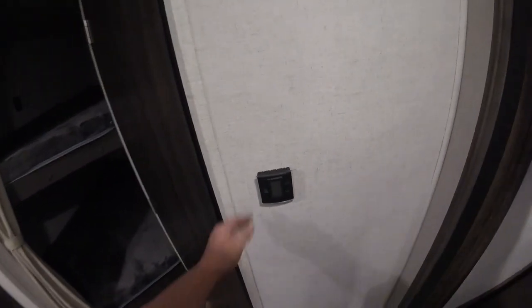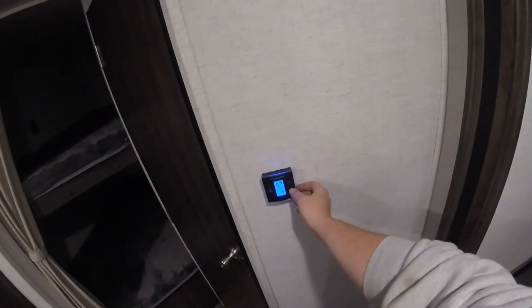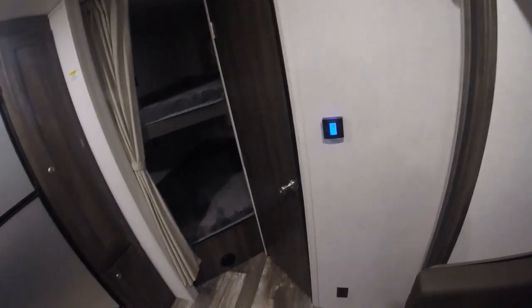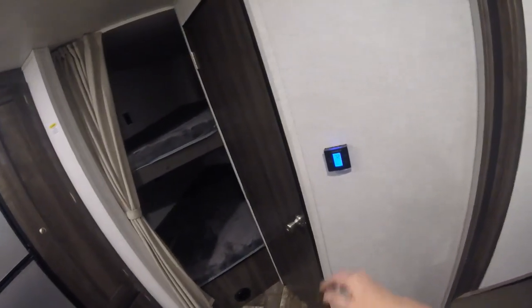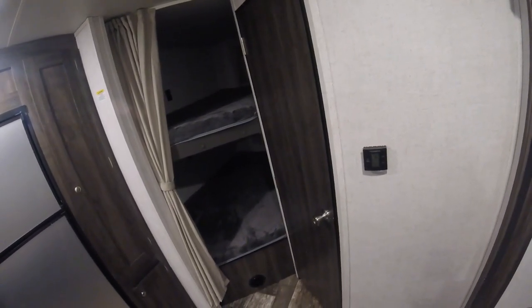This is your thermostat — it's what they call a capacitive touch unit, so it's not actual buttons, you just need to touch it. If you push hard on these they will stop working. The first press turns it on and you scroll through settings. First is fan: auto, high, and low — this runs just the air conditioning fan to circulate air. If set to anything other than auto, that fan speed runs for both air conditioning and the furnace. Next is air conditioning — set it to the temperature you want and it cycles on its own. The furnace works the same way. The furnace runs for 15–20 seconds before it lights as a safety precaution, and once it reaches the desired temperature or is turned off, it runs for another 15–20 seconds without the flame as a safety precaution.